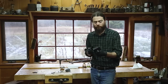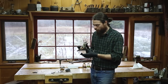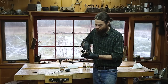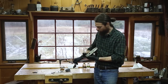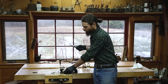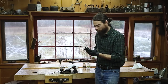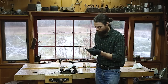This shouldn't take too much at all. When dealing with metal-bodied planes like this, first I'll take it apart. This is the cap, the frog — the iron is sitting on the frog. Take the cap off, pull that part right off. It's got this lever and you can release it. And then you have the iron here — the primary iron and the cap iron, with the second iron up on top. The condition of the edge is actually pretty decent on this one.